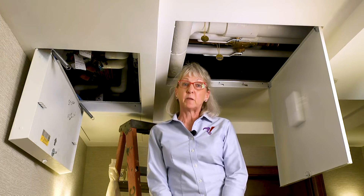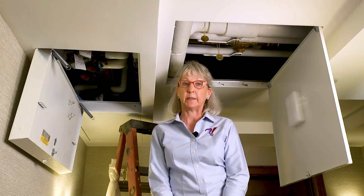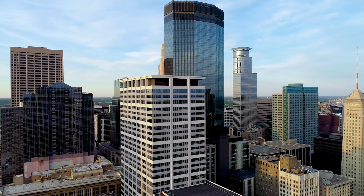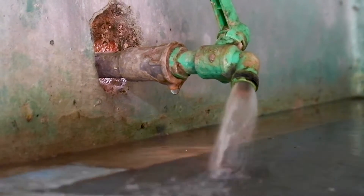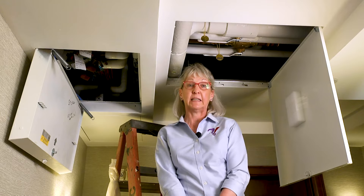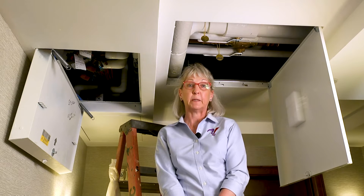It's not just isolation valves and equipment that need to be exercised regularly. In plumbing systems, especially large facilities, it's desirable to be able to isolate certain sections of piping for service while maintaining water delivery to the rest of the building. I'm here at two isolation valves, one hot and one cold, serving risers in a high-rise building. There are 20 other similar risers like this served off the same plumbing mains. The purpose of the isolation valves is to be able to close just these risers, drain down the water, and service the equipment. That's why it's important to exercise these valves at least annually to make sure you have the full range of motion and an opportunity to break off any scale or debris that may be building up on the inside.